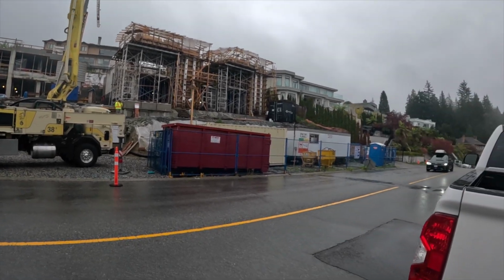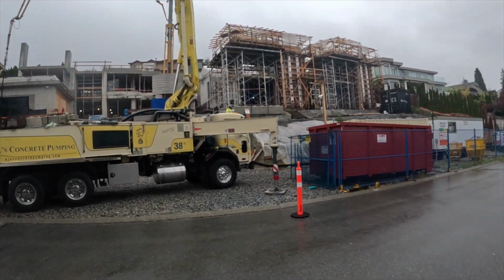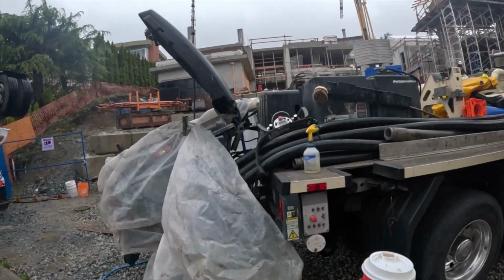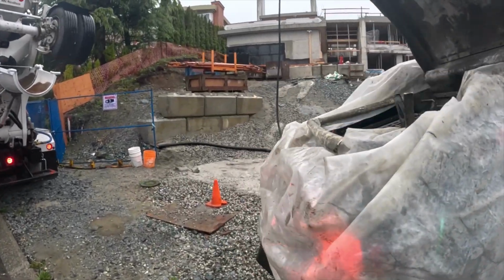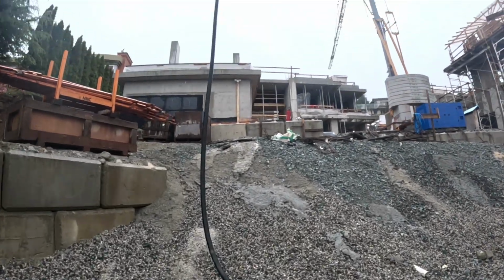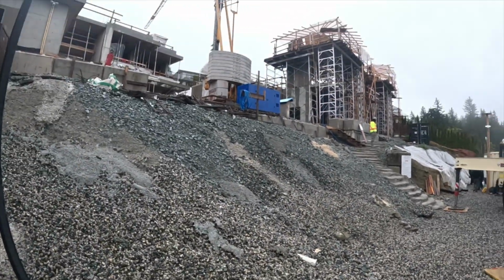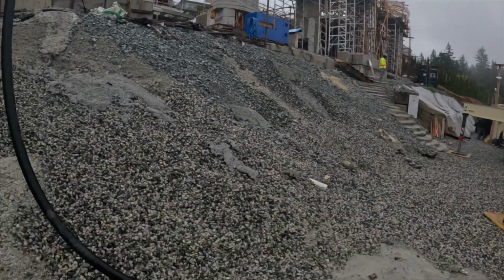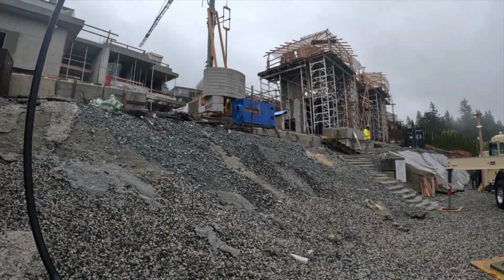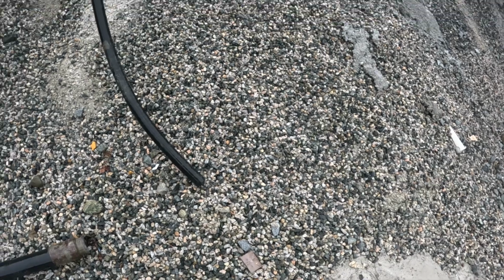Once the rush hour stuff's passing through here, which is now, we'll go take a closer look. We're doing self-consolidating concrete today, SCC, sometimes called self-leveling when used in a flat work application. So I got the 2-inch hose on here. The reason we have the 2-inch hose is we can't have this stuff splashing. Got to keep splashing down to a minimum. If it splashes all over the paper face forms, when they strip the forms, it tends to have a scabbing effect. Not desirable. So we're going to put this through a 2-inch hose.